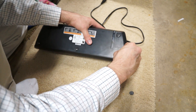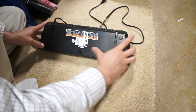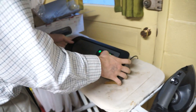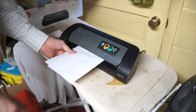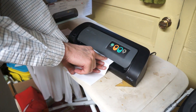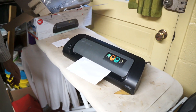Okay, feet back on. Now I'm going to plug it in. I'm going to stick it on 5 mil because that's what you normally use to laminate with. While it's warming up, just to see if it works, I'm going to stick a sheet of paper through. And it's gripping pretty good — it's going very slowly, as you can see. It goes very nice and slow, and that's what makes it so the copper and the toner stick so well with this paper. Coming out the other side, everything's ready to go. This laminator has been modified.